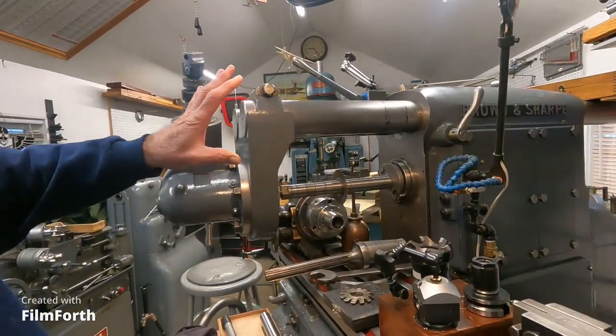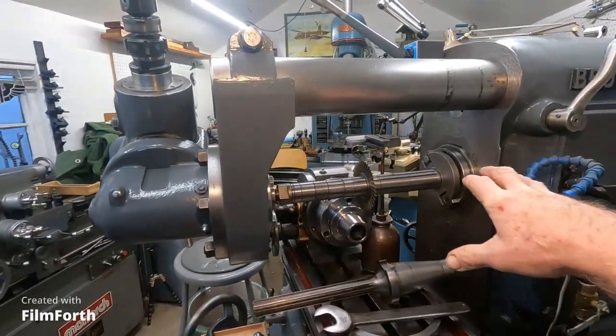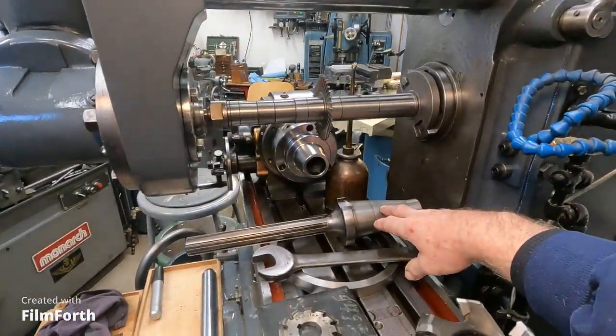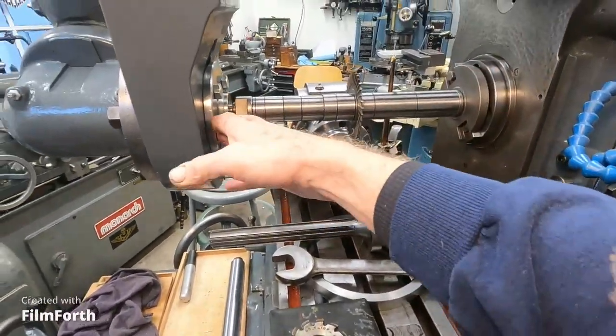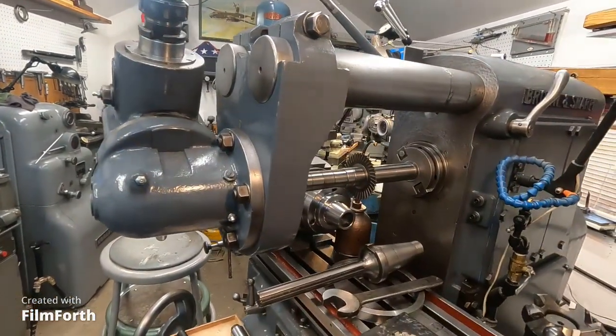Back in the old days, things were a little bit more economical — you'd buy a cutter like that and use it for a very long time. This old milling machine is really a kick in the pants, and it's really nice to have the horizontal part working. To convert back to the vertical head, the horizontal arbor is removed, then the drive splines are put in there, and that drives the vertical head.